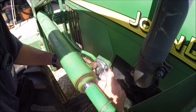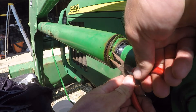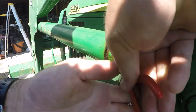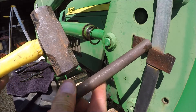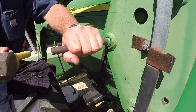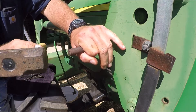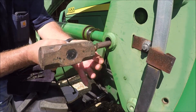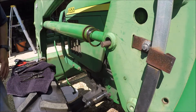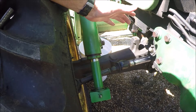Lefty-loosey. I got the persuader — that's going nice and easy. At this point I thought I could pull the rod out of the cylinder by putting a strap and pulling on it, but you can't do that. There's an internal snap ring. You can pull until the cows come home and it ain't going to budge. So I'm just going to pick up where I took the whole thing off and brought it into the bench.